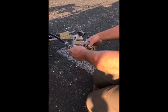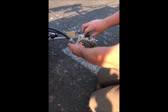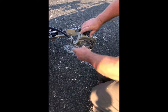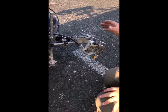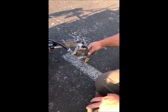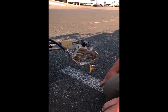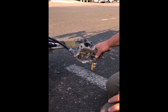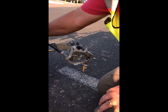Now we're just going to mount our gun and adjust the dot laser to the center of our line — I do everything center of line, but you can adjust it to the side if that works better for you. The other important thing is to make sure your gun is at a 90-degree angle to the ground. If your gun is tilted and you adjust your dot laser from there, it's going to throw off your long line laser, so make sure your gun is at a nice 90 to the ground, then snug up your wing nut.